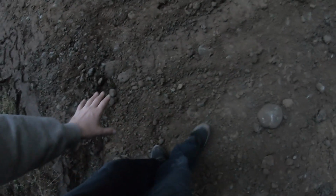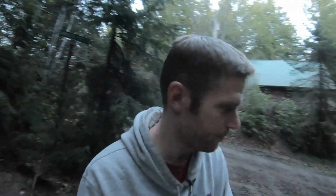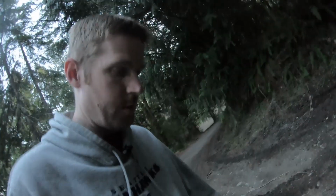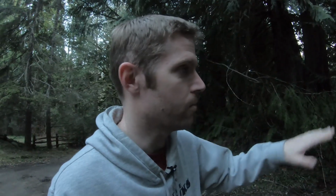Looks like the water should drain right out here, and it might puddle a little bit. It'll fill up, be like a couple inches deep, unless I dig this out a little bit more, which I might. The water should just flow right through here without giving us a ton of potholes anymore. Problem is just right under the surface, there's these huge, big round rocks from when they originally made the road. So it makes it hard to really get it nice and smooth when it's just all big rocks under there. I've got just a couple inches of this 5/8 minus, and that was not enough, of course, to smooth all this out.